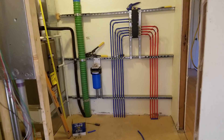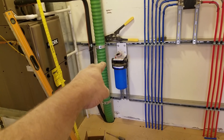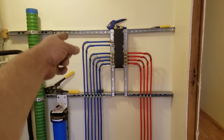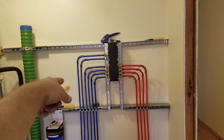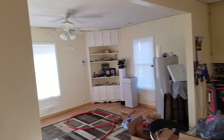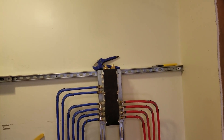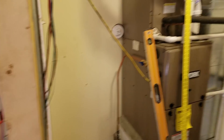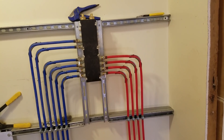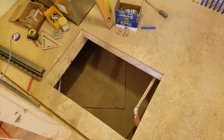I'm doing all the plumbing in the house right now. My main is going to come in here, through a whole-house filter, then tee off into my water softener. Out of the water softener it goes to the hot water tank. I'm only softening the hot side — I'll do a separate video on that. This PEX is pretty easy to work with, it's just tough going down there.